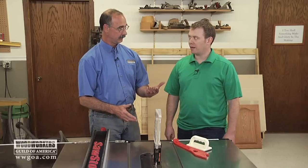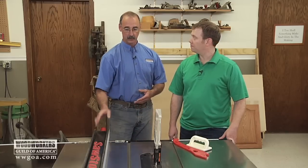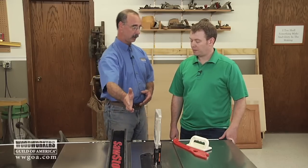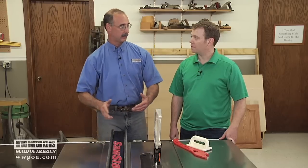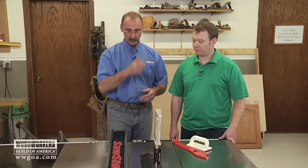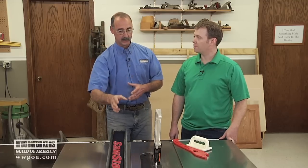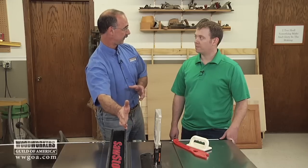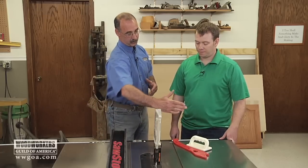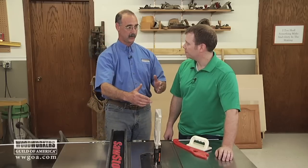You're right-handed? Okay. So for the most part, for you, you're going to be to the left of the blade, to the left of this slot. If you're doing a rip cut with the fence in place, you'll be pushing with your right hand and just kind of turning your hips to keep yourself away from the line of cut, the kickback line of the saw blade. When students are tentative about a table saw, they tend to stand back away from it, which is natural. But as you're making a cut, you run out of arm. You don't want to get to where you can't reach far enough to finish the cut or you're leaning a lot. You can locate yourself so that your hip is right up against the beam of that saw — you're as close as you can get — and that way you can push stuff all the way out onto the outfeed table.